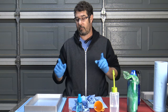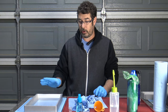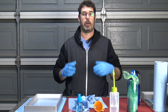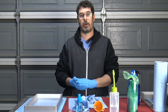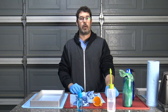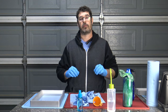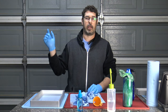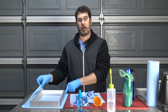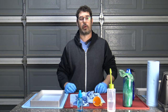This is ready to go. You now have a vat ready to either replace the FEP or change your resin types and pop it back in the printer. Before you do pop it in, take a lint-free cloth, wipe it down, make sure there's no dust or hairs or anything dry collected on it before inserting it into the printer. Make sure that you've wiped the top of the LCD in your printer off to make sure there's no dust there and everything is clean. That does it for today's episode — I am going to go clean up my mess now. Remember to ring that bell, like, and subscribe. If you're interested in the Filament One Starter Pack, there will be a link in the description down below. We'll see you next time on Practical Printing. Aloha.